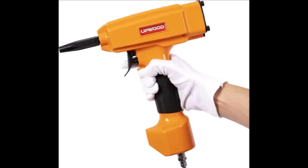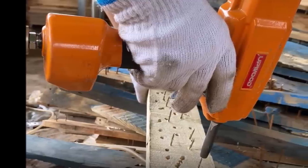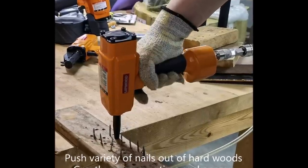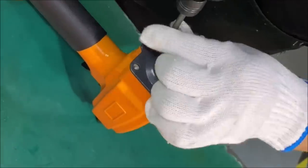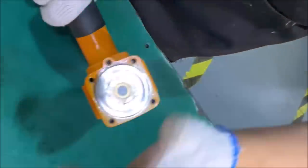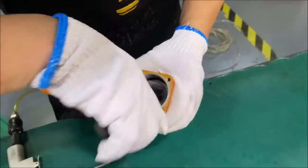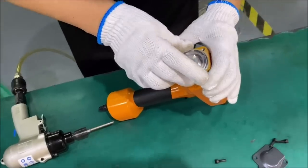Number fifteen: the Professional Air Punch Nailer Nail Remover, priced at $49.90, is a versatile tool for efficiently extracting nails from a wide range of materials. Operating within 80 to 120 PSI, it requires an air compressor and handles nails with a maximum diameter of less than 0.197 inch, pulling nails up to 2 inches per cycle. It works on floorboards, weatherboards, fiber sheets, skids, pallets, boards, barn lumber, sheathing, and wooden decks. Compatible with soft and hardwoods including pine, poplar, and oak.